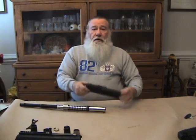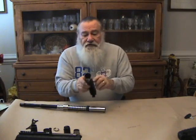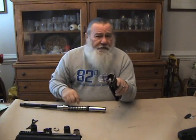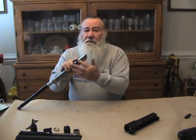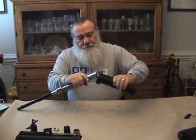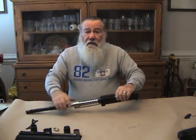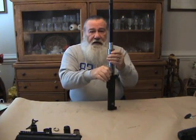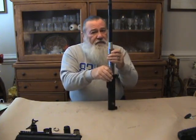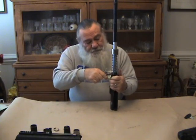And when you pick up the rear part of your upper, you'll notice that there are little channels in there. You're going to notice these on just about every bullpup out there and some semi-automatic shotguns. So just squeeze this together, and these two runners on the bottom of the bolt rod assembly fit right in there, and it slides right in. Don't slam it in, because you're thread on thread again. At this point, take your time, make sure you're not cross-threading it. It comes off pretty easy, but for me, I don't know why, it's a bear to get back on.